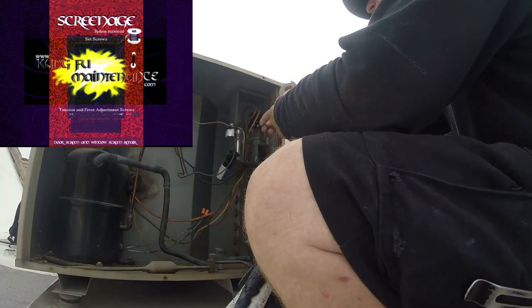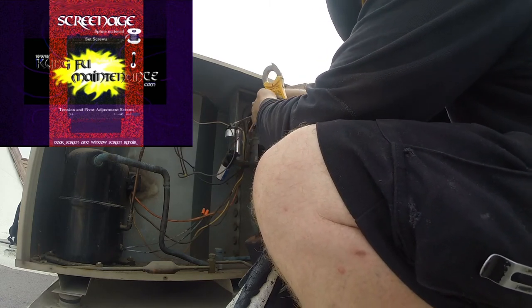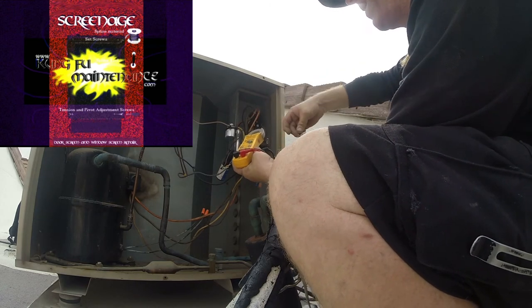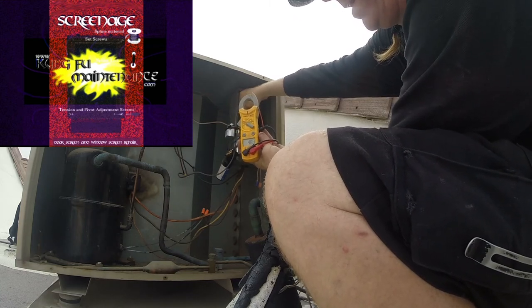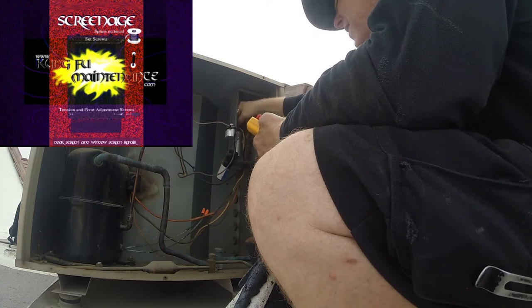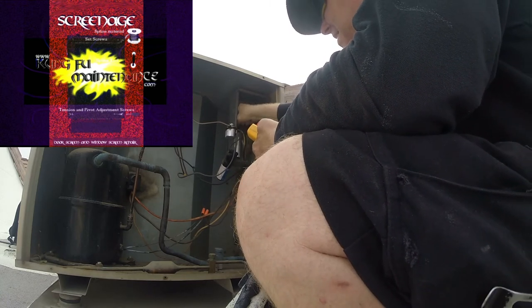Enough rambling for now, thanks for watching. More on the works — comparing a hard start setup. I don't see these failing very much. I hear other people saying that they do, but I'm not seeing it very often. Not that I've never had them happen — I've seen them melt — but they're supposed to be taken out of the circuit after a brief moment. Forty-eight point one — that's good. Reconnect everything back up. The unit just turned on — that one is wanting some cooling. A quick search on my YouTube channel for whatever your maintenance needs are should find helpful material.